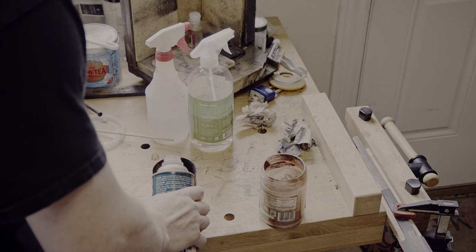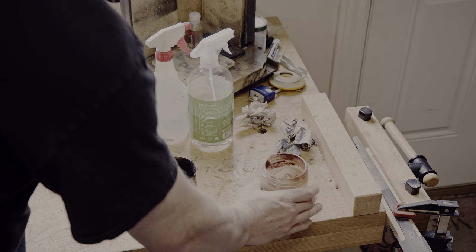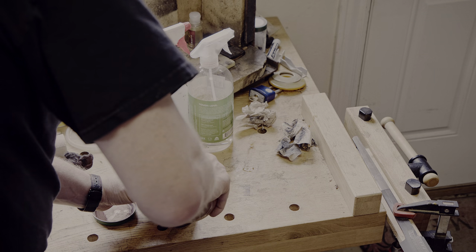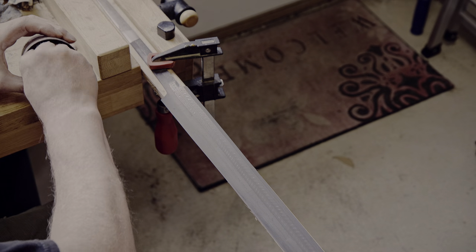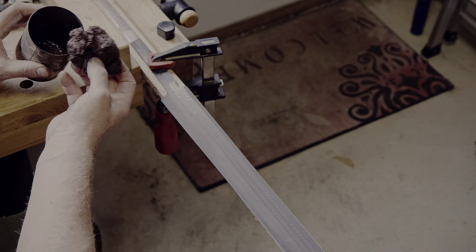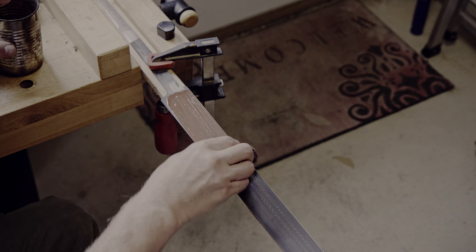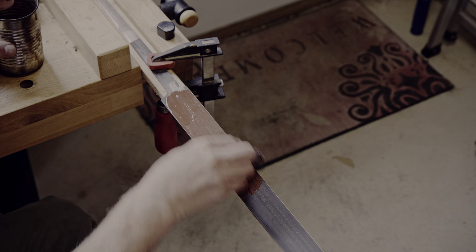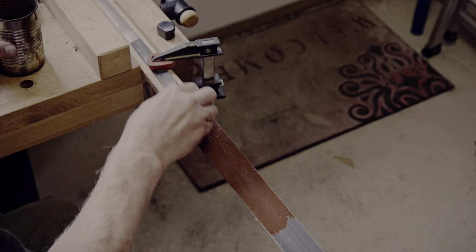After the metal polish, I'm using fine steel wool as the final polishing pass. In addition to the steel wool, I'm using a mixture of oil and red iron oxide that I have mixed into a slurry. This is quite a mess — in fact, a whole bunch dropped on the floor and after wiping it off, it sort of looked like blood stains. But the beautiful pattern in the steel is slowly being revealed.